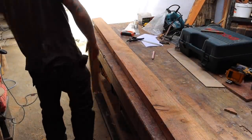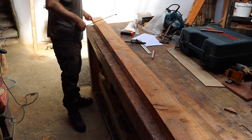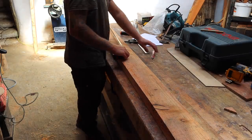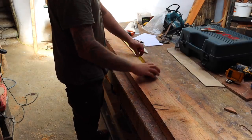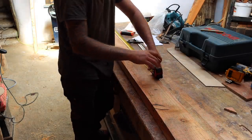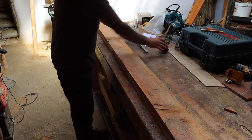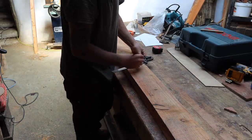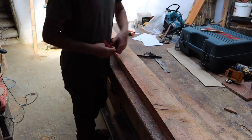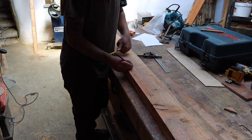Right, so my roof pitch is 20 degrees, which I've got up here. It's called a plumb cut. I measured down there, I've got a measurement that worked out. It's 15.26. Currently this measurement's not including the thickness of the ridge, just to allow me a bit of tolerance until I get the first ones laid out. 15, 20, 6. Copy that angle back there. And then the bird's mouth is 40 millimeters. So we go like that to 40. There.